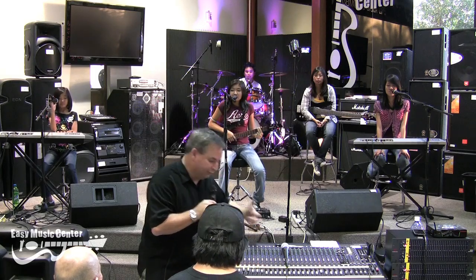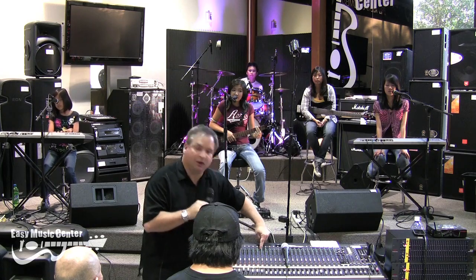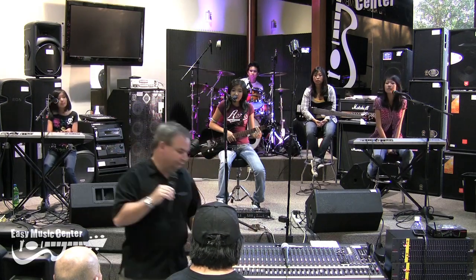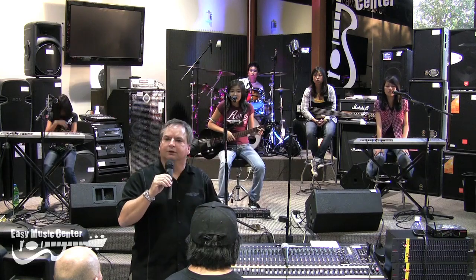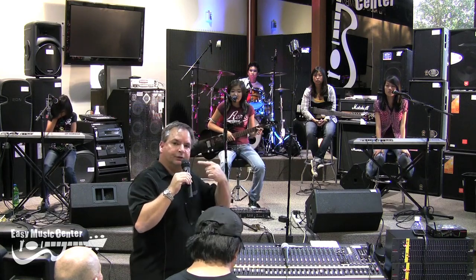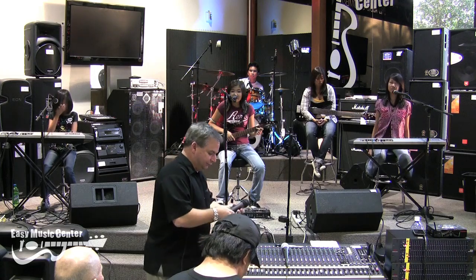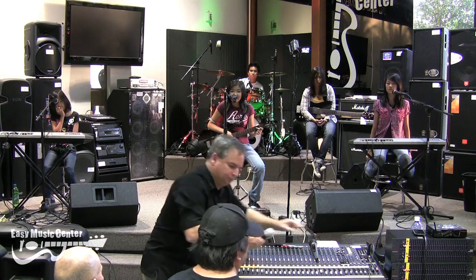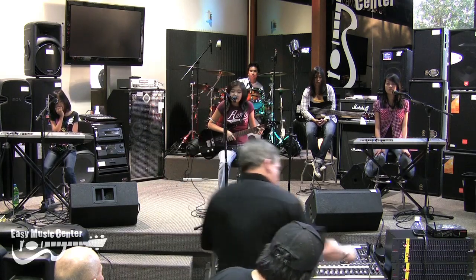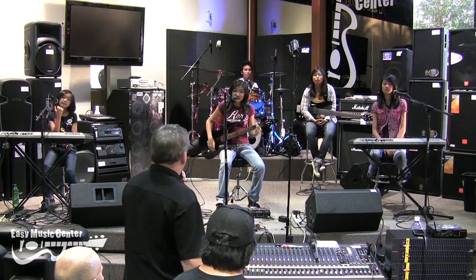So if I push on the Yamaha mixers, there's an 80 cycle. It's called a high pass filter. And all that does is knock off everything below 80 cycles. And there's some really weird stuff happening with my mic and theirs. So as we go along, I may switch over to this other microphone. To check. That's better. Still we get it.